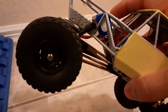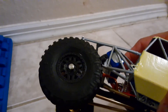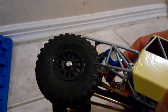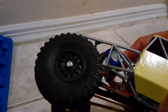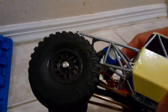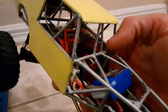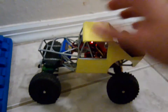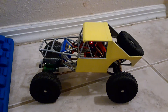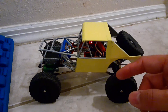This is an 1800 KV motor. If we get a slower one, it'll have even more low-end control. Also, what I'm using is one of those 10 amp ESCs from Hobby King. Those are not really adjustable or programmable. So if you get a better ESC, you can obviously make this function a lot better with that little motor.